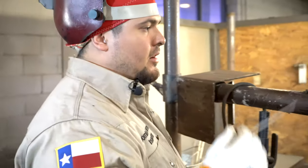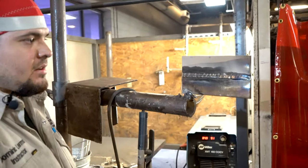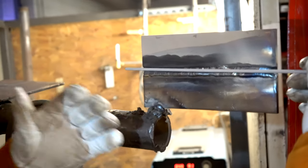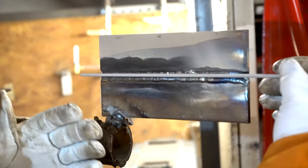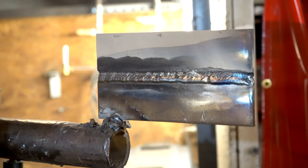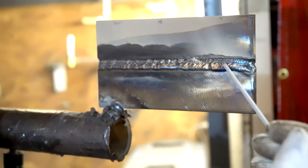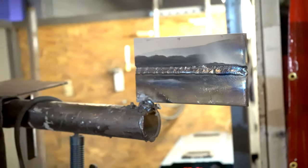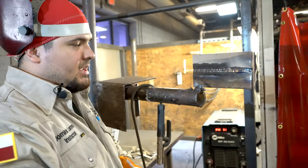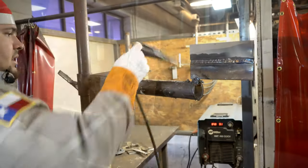So now we've thrown our first cap, our bottom cap. All right, now our second one is gonna go directly in the middle. All right, directly right there. I'm still going to overlay on my bottom bead. All right, and I'm doing the same manipulation as I did for the fill. I do the same one for the bottom cap, that middle, and then I do something a little different on that top one. All right, simple. Keep it the same, all right? Consistency. Alrighty, let's get it.